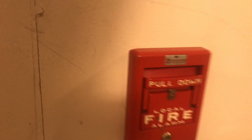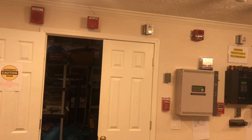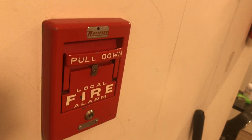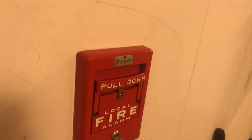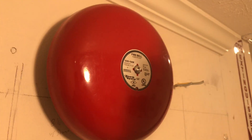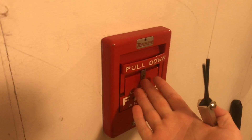A lot of you may be thinking: what the heck is a coded pull station? The coded pull station works by having its own address — it's kind of like an addressable system but really basic and old. This pull station itself is from December of 1964. I was very lucky to find a Notifier branded one in such wonderful condition that everything still works. It has this little number plate on front that says 243 — that is its address.